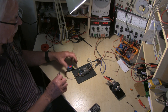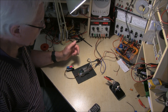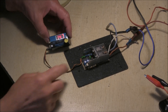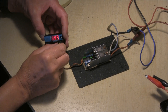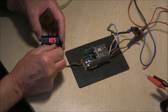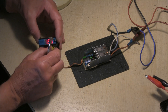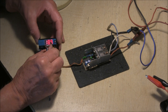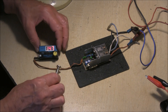First of all you've got to make sure that in the middle position of your transmitter — neutral — neither of the relays are operated. Luckily you can hear and see them. So with this set at neutral I turn it slowly one way and you've got that relay operating, the other way the other one. Now if it's too sensitive it operates too early — you need a bit of movement before it operates, so you can back off the sensitivity. It's actually easier once you've got it like that to adjust it with the motor connected, which I'm going to do next.